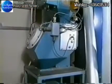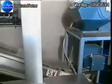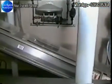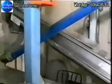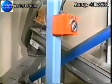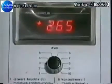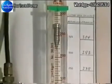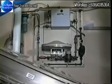Roller milling is greatly assisted by conditioning or tempering the grain. This involves first wetting the grain to raise its moisture content and then allowing it to stand for up to 18 hours. This toughens the bran, reducing its tendency to powder, but still allows the endosperm to fragment. Hard wheats are conditioned for a longer time and to a higher moisture content than soft wheats.